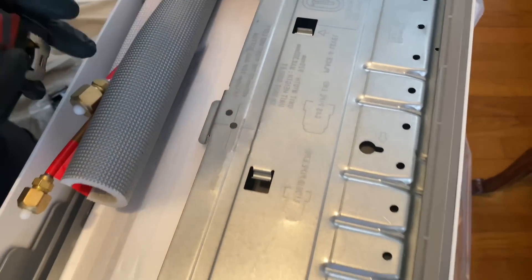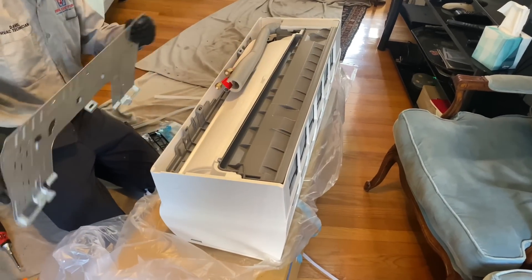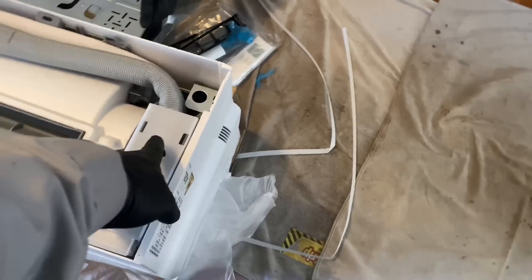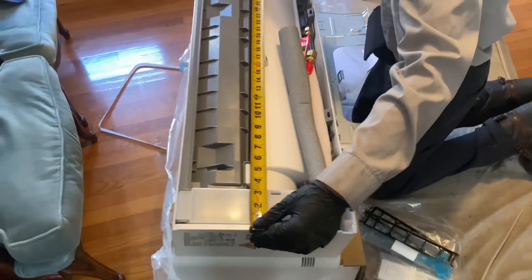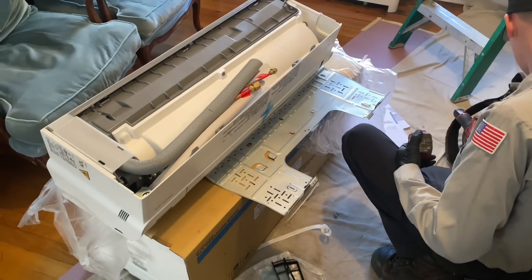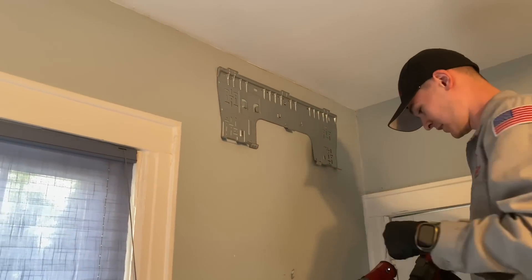Center is 17 and a half — checking. Yep, 17 and a half. Like the Fujitsu, our electrical connections and discharge for condensate and line set is on the left side. We'll bend that straight up on a 90 degree angle and go straight out the back — no mess, no cleanup, no need for the mighty bracket to hold it in place while we install it.